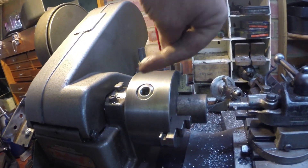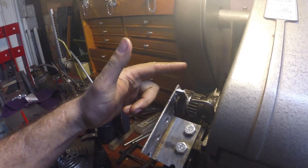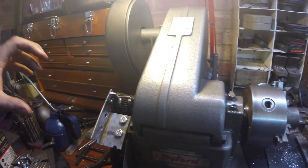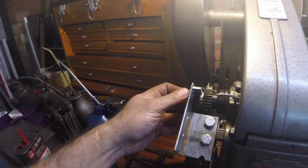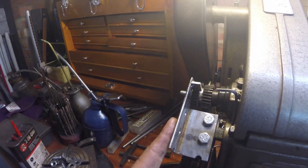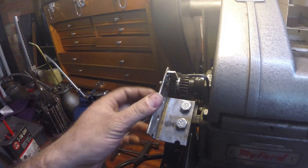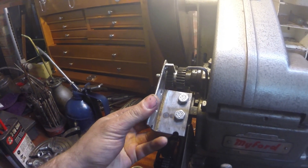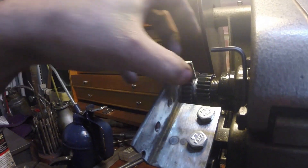There's a thick washer I machined up, a bit of threaded rod that runs through, and it's all clamped together nicely. I ended up super-gluing the gear to the arbor, and with the tension running through the headstock that holds it nice and steady. It attaches onto where the guard normally goes — it's got a little key thing there and it's quite solid.